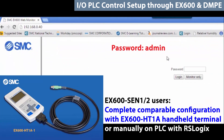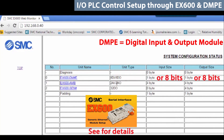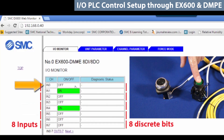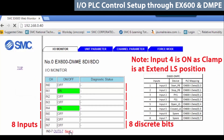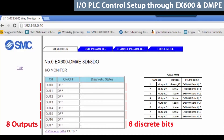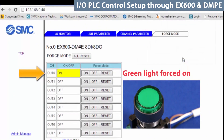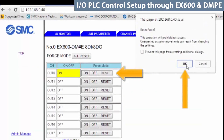Open up the EX600 web monitor and enter as an admin. Click on the DMPE module for digital I/O. Pushing the start button shows up as green on input 0. To see the outputs, click on OUT 0-7. Notice none of them are on because we've not started the PLC. To test the light output, go to force mode. Turn output 0 on — notice the background is yellow now and the light should be on. Before leaving this screen, remove the force by clicking reset.